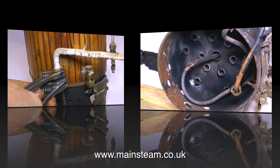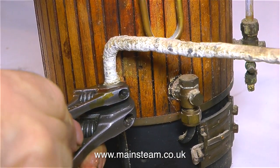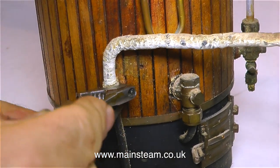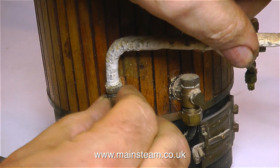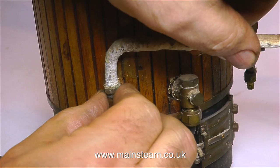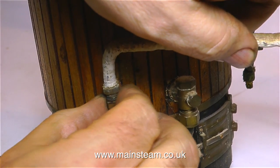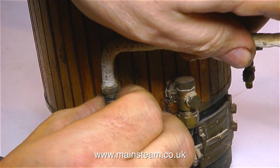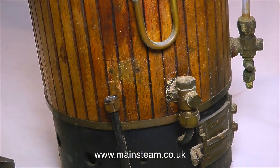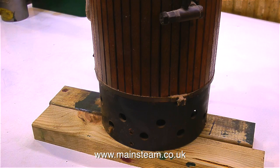It's a little bit more than a quick look at the boiler. I'm getting the boiler ready for the hydraulic test, so I need to remove all of the ancillary equipment apart from a couple of taps. This is what remains of the main steam feed to the engine, and it's no good - it doesn't have a lubricator. I will be re-piping the feed to the engine in an entirely different way, complete with a superheater, a displacement lubricator and a regulator.